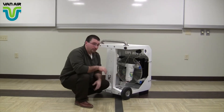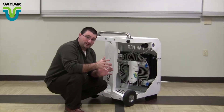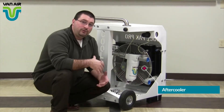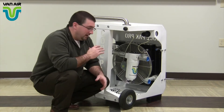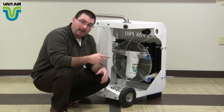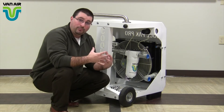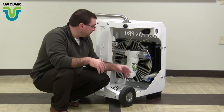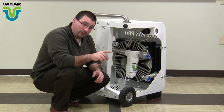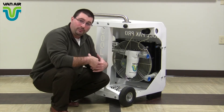Let's talk about the features of the CoolPak Pro. First and foremost, it's an aftercooler system, so it has to have an aftercooler. Your inlet is at the bottom. For anybody who doesn't know what an aftercooler is, it is a unit that takes in the hot compressed air, uses ambient air blowing across the fan to draw out the heat of the compressed air — basically radiates the heat away. As that hot air passes through the cooler through all the different passes, it'll cool it down, and moisture drops out whenever you're able to cool that air down.